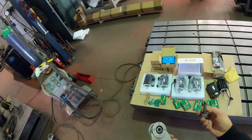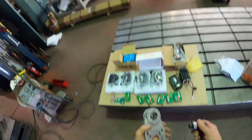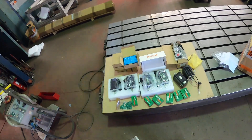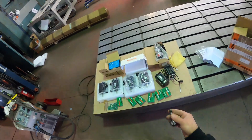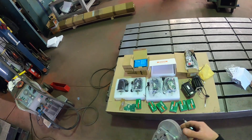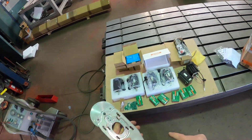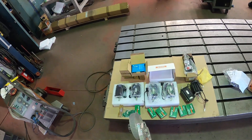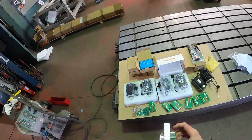The bolts are a special story — they are very expensive. I think the 35-length ones cost something like 93 euros for 25 bolts as of February. The reason they're so expensive is they are not F9 standard. For normal projects people use F9, but this time I used H8 — so it's fitting H8 in H7 — really really tight and really smooth, to get less play in all these applications.